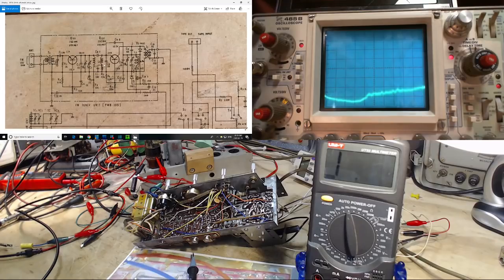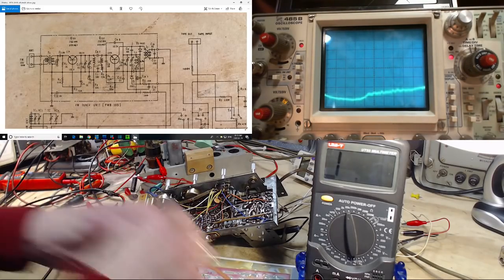Well, I should be able to read across this resistor. If I put my ohm meter across the resistor, and no current. Well, see, I'm not quite sure what might leak through a transistor, but let's assume nothing. So I should be able to put my ohm meter right across this resistor and read 22K. Let's try that. Is this really 22, or is this guy shorting them out? 22K, okay.